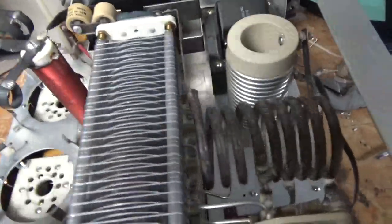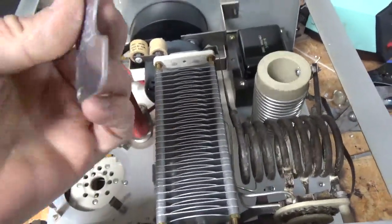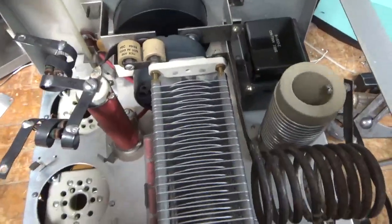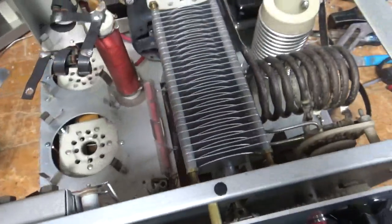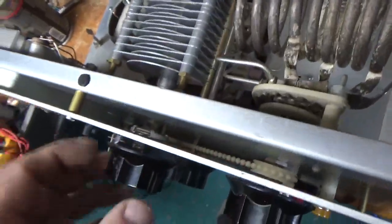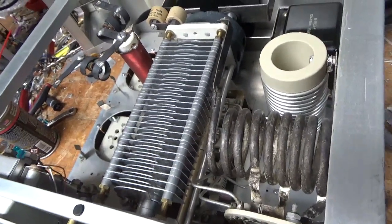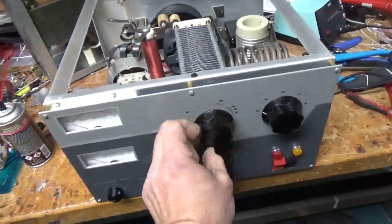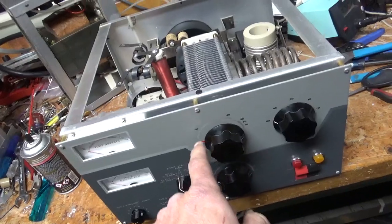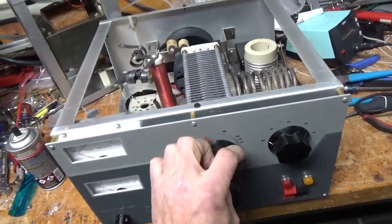Ended up rebuilding the one that was in it. You can see some of the back plates — took out two of these and two of these — and now it's good. I also had to change the vernier reduction drive. I put the new one in and now it rotates as it should. This one was slightly different, so what I did was drill a hole in the pointer assembly and put a screw through into the vernier drive. As you can see, it works as it should.